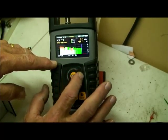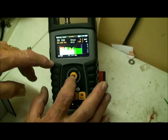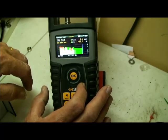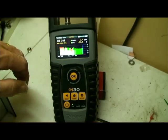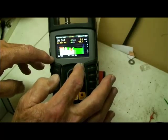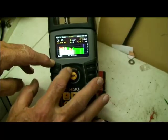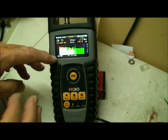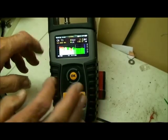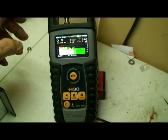Now I'll go all the way out here, and that is channel 102. There's 107. So there's a reasonably good level. At 107, I've got about 2.4 dBmV. Let's go down to the other end of the spectrum. I have about 2.2, yeah, 2.2 dBmV. So basically, I'm almost flat across the board, and that's what we should expect.